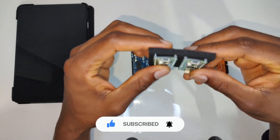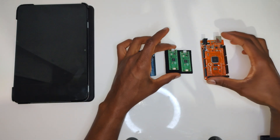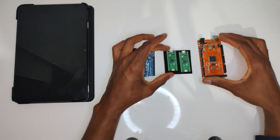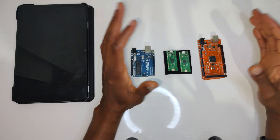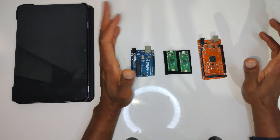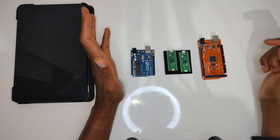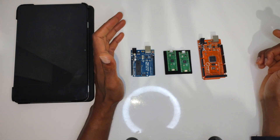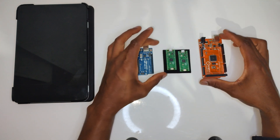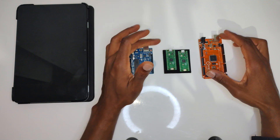We have a micro USB port. You plug it into your PC, drag and drop the firmware to tell it it's a programmable device, and from there you use the Thonny IDE — I'll be showing that entire setup in the next video. You simply program in Python, press run, press play, or drag and drop the file, and you can program this tiny device in Python. It's one of the best entry-level, high-level programming languages.